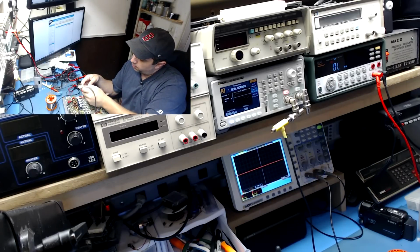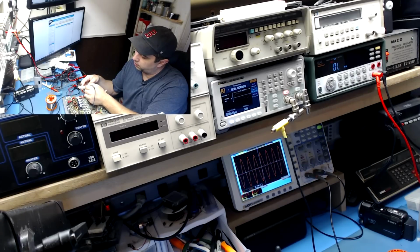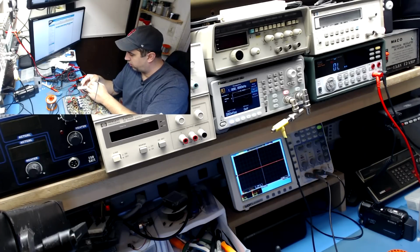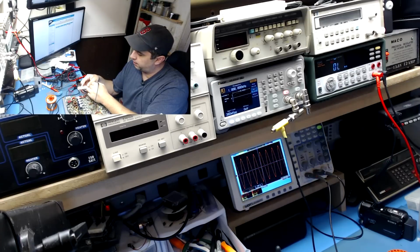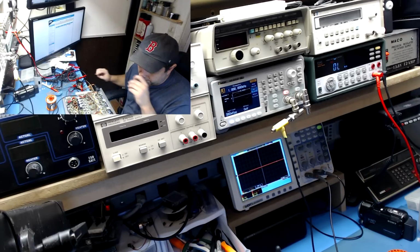So let's check the known good channels. We got 1, yep, good. We got a sine wave. 2, yep. 3, good. 4, we're good. 5, we're good. And here's the bad channel. 6, yay! All right. So that is it. We got the channel working again.